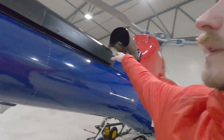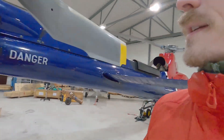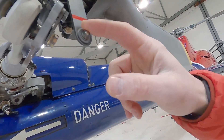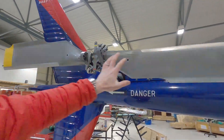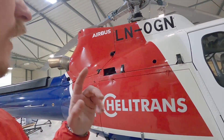The other day we did the tail rotor, where you have the shaft that goes inside this cowling here. The solutions on those are little screws and washers that you add or subtract — that changes the balance position on the diagram. The diagram outlines a circle with many degrees, and everything is measured in inches per second.